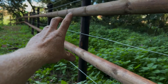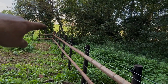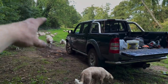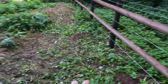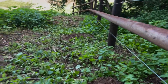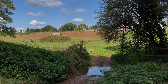So what we've got is two plain rails - these will be tightened up, they're tight enough to keep the sheep in for now. And then same height barbed and the same height electric. The idea being we can connect up our electric, probably run it overhead over the brook, all the way up to the mains. Or if it needs to be, we can bring the solar or battery over here as well. I kind of like the idea we can run mains round, and then we can always divide all this land up into different fields, different paddocks, and know that we've got plenty of power going all the way. If we did ever want to run pigs loose in here, we can bring out an offset insulator with a poly wire electric on it, and that would keep them away from the fence altogether. You can see where they are up on the bank - they are being held in by two very thin strands of poly and they never touch the stuff. In actual fact, it's been turned off for the last 12 hours because I was using the extension lead and forgot to plug it back in.